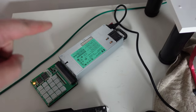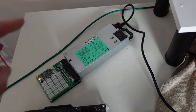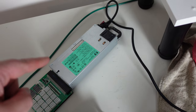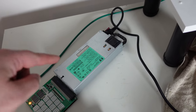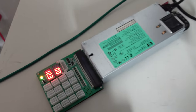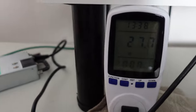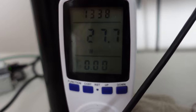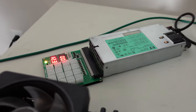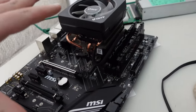The ATX power supply is out of there, it's gone. Because we are running this on 120 volts, this 1200 watt PSU is now only max rated at 900 watts — keep that in mind. I believe if you're only on 110 volt it's only 800 watts, but if you are on 220 or above, this is a full 1200 watt power supply. It does use a little bit of power itself. The breakout board is currently off — I'm going to turn it on to see its idle power draw so I can monitor consumption better. It looks like we are at 27.7 watts pretty consistently, with the odd spike to 27.8, so I'll write that down and subtract it from our total reading.